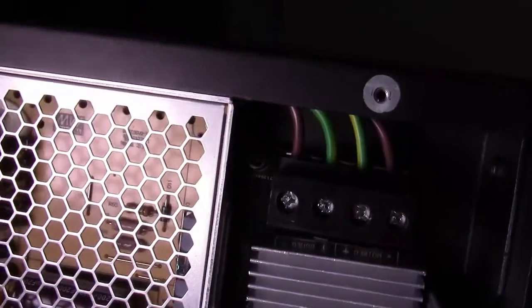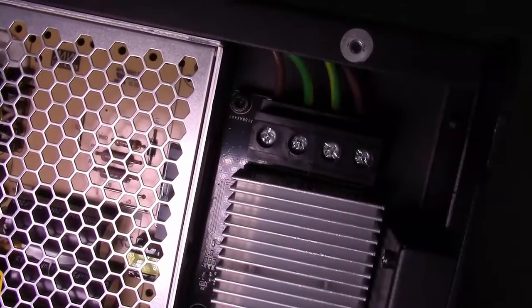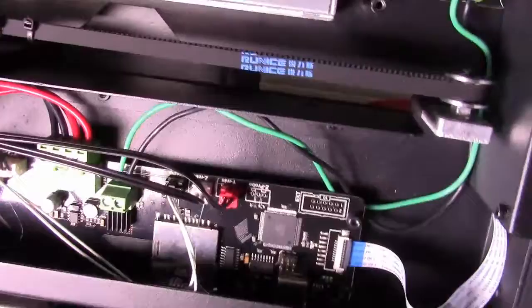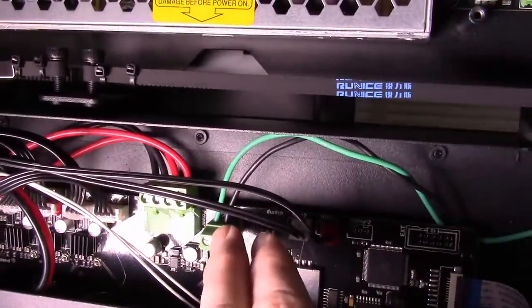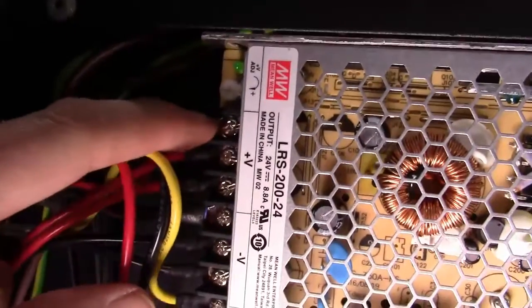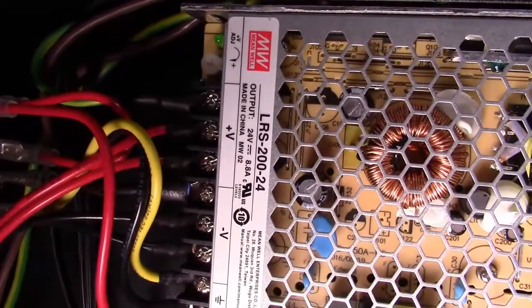What was done is: the MOSFET board — I added two extra mounting holes inside the control area and screwed that down. The line that used to go to the heating bed runs up to the control input on the MOSFET board. Then we have the heating bed wire that runs back around and goes out to the heating bed. And we have a new 24 volt power feed coming into this board from the remaining screw terminals for positive and negative off the power supply.